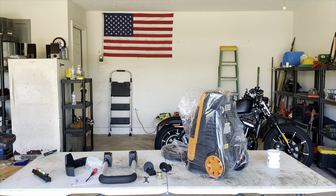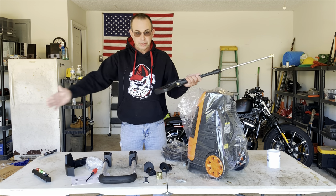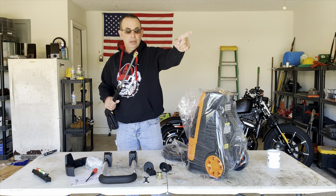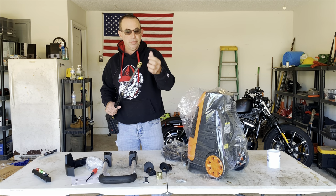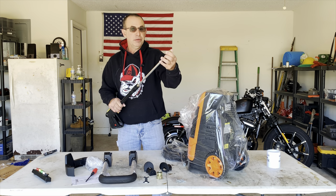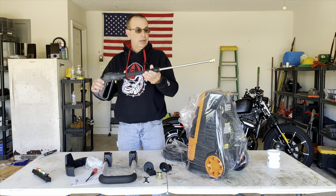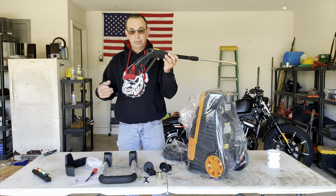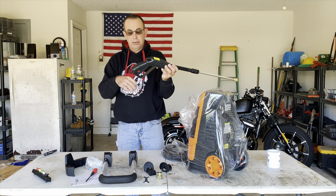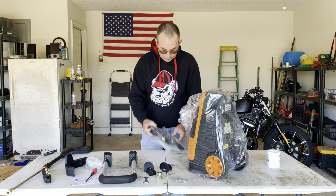So note to self, guys, whenever you're using a pressure washer, whether it's an electric pressure washer or a gas-powered pressure washer, if you take the tip out and you're under pressure, even if you turn the machine off and there's pressure backed up in your wand and in your hose, and you squeeze the handle, you're gonna blast the O-ring out. Then when you put the tip in and you get ready to pressure wash again, you're gonna get sprayed in the face because there's gonna be no O-ring in there. So always be in the habit of turning off your machine, cracking the pressure out of the line, and then removing your tip. Same with any quick connect on any pressure washer, whether you're doing hose to hose, or a tip, or if you take the wand off. Let's say you got a ball valve and you turn the ball valve off in the middle of your line or right here and you don't let the pressure out and you pop the coupler, you're gonna blow the O-ring out as soon as you pop the coupler. And that's irritating as hell. So just a quick little pro tip there to help you guys out.